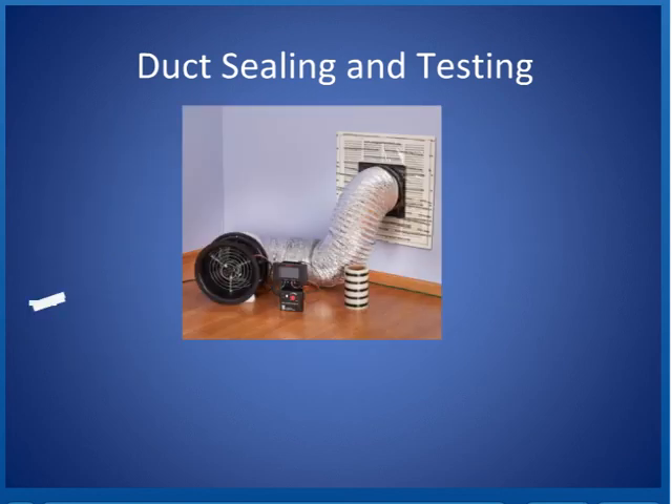As the leaks get smaller, we're going to need to test the duct. It's a good idea to test in and test out. If you have ducts leaking like a sieve — disconnected with giant holes — there's no point in hooking up a piece of equipment like this, unless you want to show 50% improvement by doing very little. Any time you want to take a measurement of the airflow going out of a duct system, you need to put airflow in.